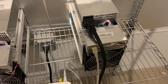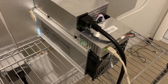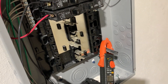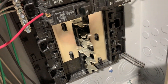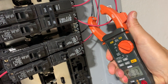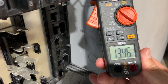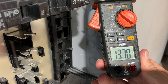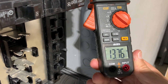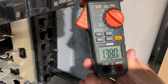Let's head over to the panel so that we can check the amperage it's running. Here we are back at the panel. I'm going to measure the amps of the M20S demo. Clipping on here — it is 13.6, 13.7 amps. Remember, this is at 240 volts. If you're at 220, it's going to be a little higher than this, and we're running at 65 to 66T. So there you have it. This is Joe Crypto, over and out.